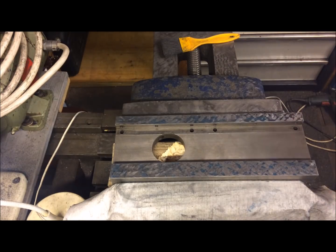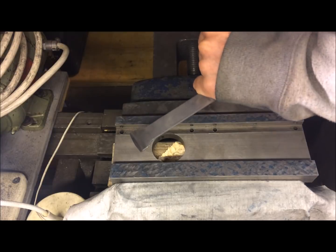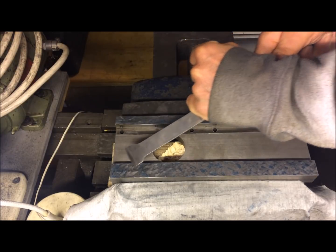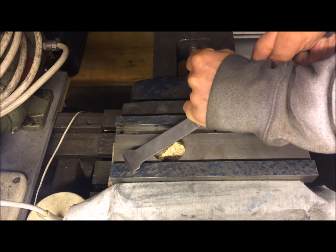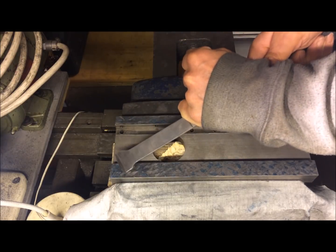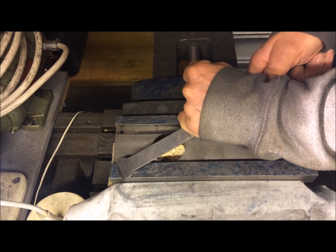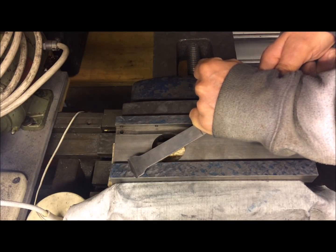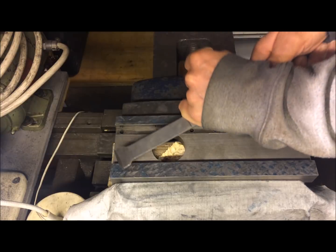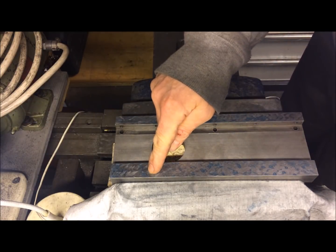This is the result of rough scraping. As you saw, I used the tap and go. When I went forward, I pushed down into the workpiece and lifted up, released the pressure and lifted up before I ended the movement, and did not return while I was down. I lifted up — that reduces the formation of a burr.